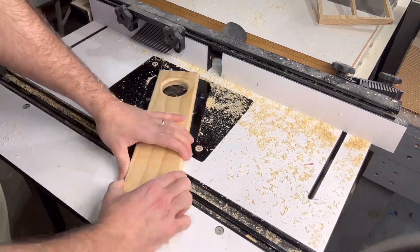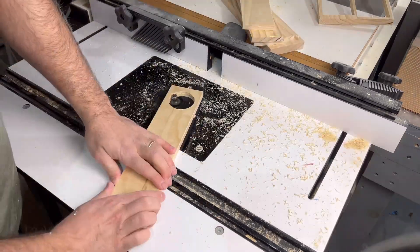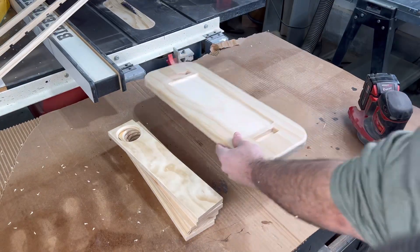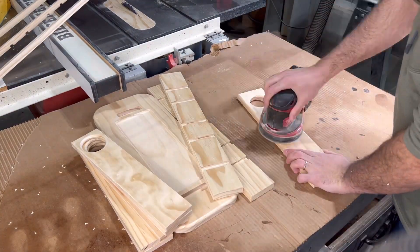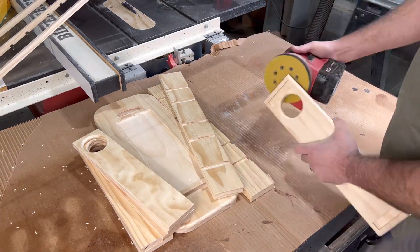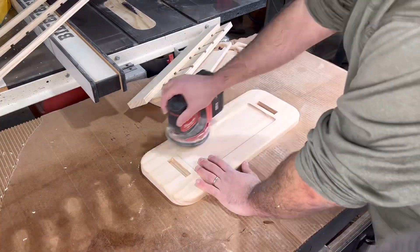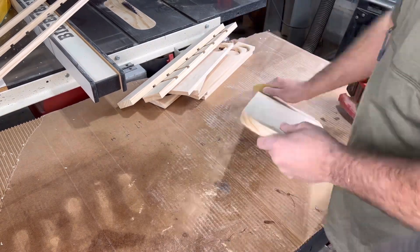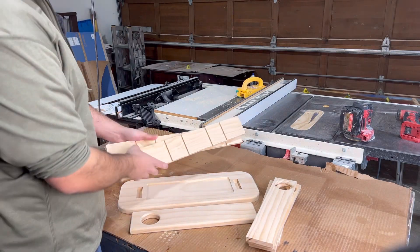For the top cover, we're going to go around both top and bottom. For the base, we're going to go over just the top. And for the ramps, we're going to go over the top and bottom of only the holes that we drilled. From there, gather all the components that you've carved and worked on so far and get to sanding. I sanded up to 220 grit sandpaper, but you can sand up to whatever grit you want. And as you sit there and watch me sand, don't forget to hit the subscribe button if you're enjoying this video, and leave me a comment if you have any questions or video suggestions.